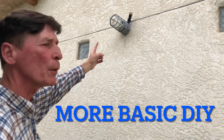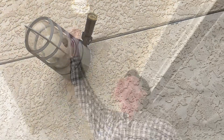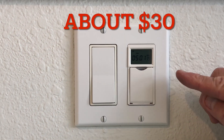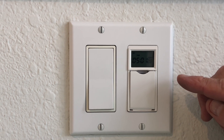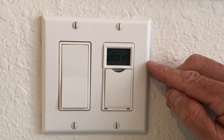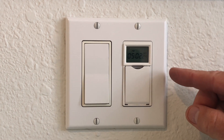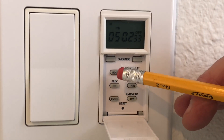This exterior light similarly has a day-night sensor wired right into the light. These recessed exterior lights are very difficult to put a day-night sensor on, but you can wire in a timer that works just as well and it's actually easier to install. These wall light timers are one of my favorite tricks — I use them for the recessed lights on my house. They're also good if you have a light in a dark porch area or a dark entry to your home. I use them timed to come on at dusk and to go off at sunrise, and they adjust on a daily basis so that as the sun rises and sets at different times, they adjust accordingly. They'll come on at 4:50 p.m. in the winter, 8:30 p.m. in the summer, and no adjustment is necessary. The buttons are awfully small — when I program it, I use a pencil tip.